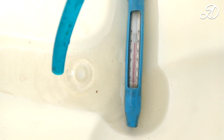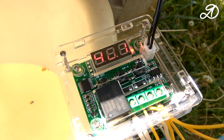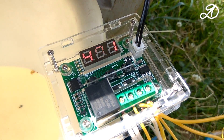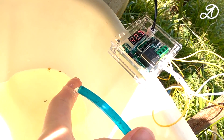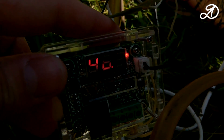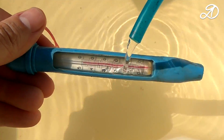Now with the help of the thermostat at the outlet you can get water at a higher temperature but in smaller quantities. I have it set on cooling to 40 degrees Celsius; the hysteresis is equal to 2. When the temperature drops to 40 degrees the relay opens and the pump is switched off; the pump switches on again at 42 degrees. The water temperature may differ by several degrees from the sensor readings. I even managed to heat the water over 50 degrees — then the thermometer reaches the end of its scale.